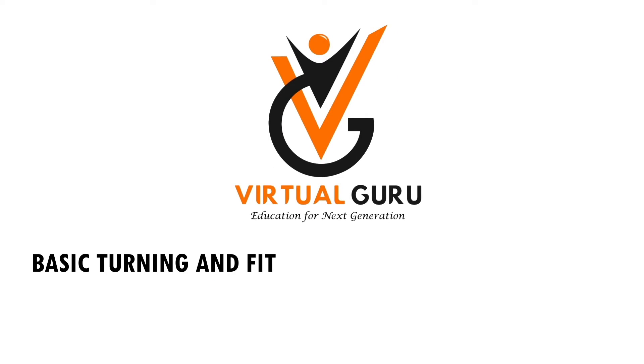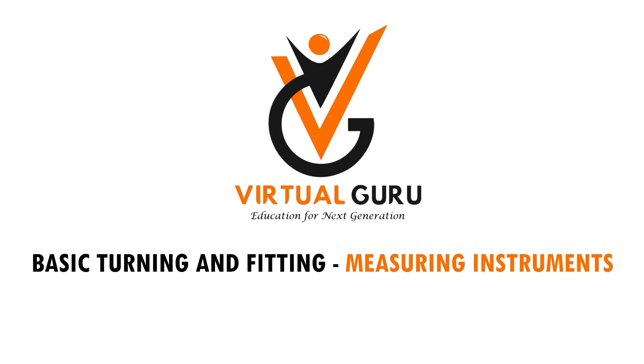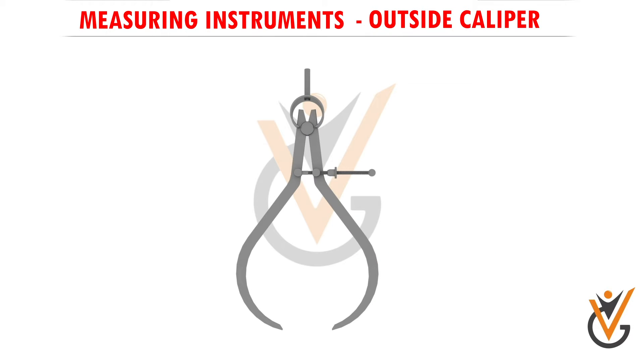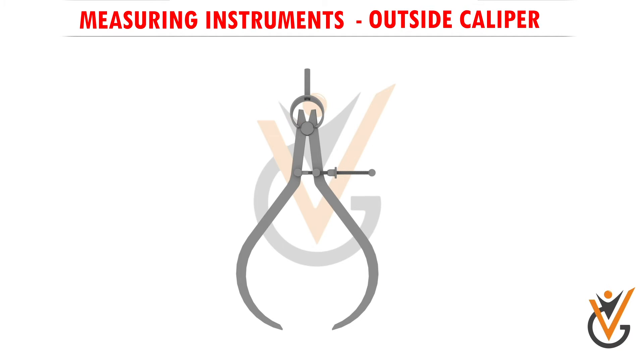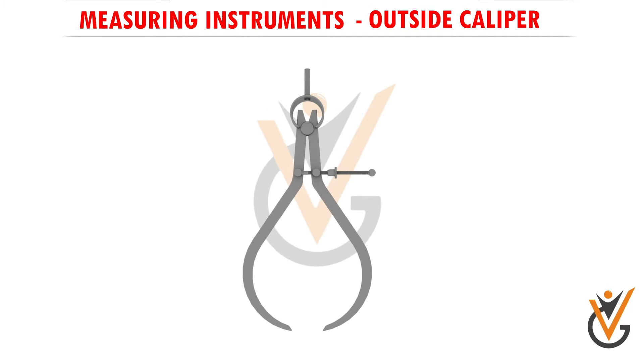Basic turning and fitting measuring instruments. Outside calipers measure thicknesses and outside diameters of objects — parts include the fulcrum, roller spring, knurled nut, ball adjusting screw, and jaws. This is a set of outside calipers; you can tell by the measuring edges — these two measuring edges are meant to measure outside diameters. These happen to be spring joint calipers, so as I squeeze them there's a spring that loads onto a nut.